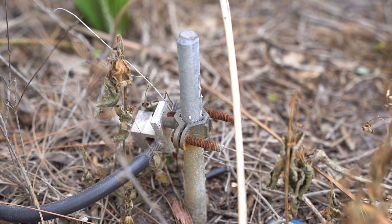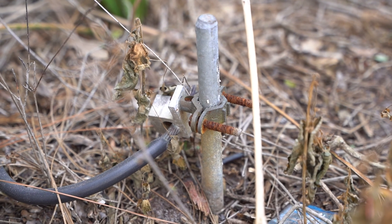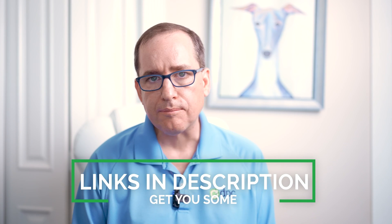The 16-gauge wire coming out of the device then goes to a grounding block. For a commercial installation, your electrician will typically install a grounding block on the wall. The device specifically calls for 16-gauge wire, which is smaller, but this isn't for a major electrical strike — it's for static and ambient electricity. That grounding block then connects to a grounding bar for the office or house. I'll put a link to Amazon where you can buy a grounding rod — typically an eight-foot copper bar sunk into the ground. Once bonded into that ground bar, it is properly grounded on the inside.